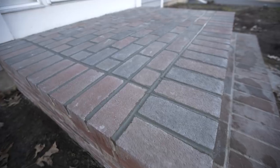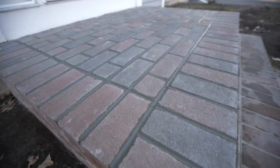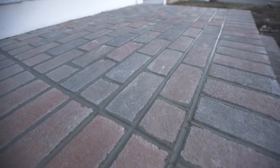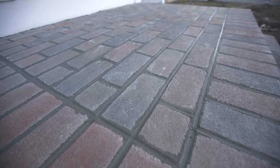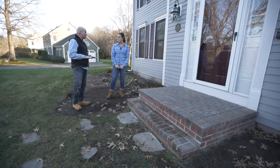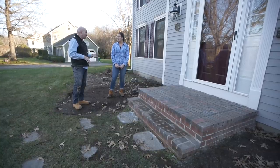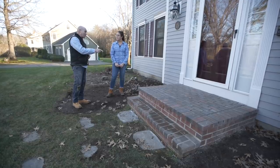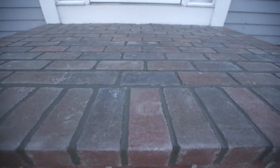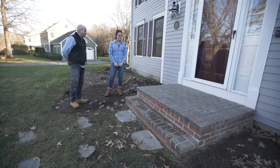Okay Michaela, what do you think? They look amazing, they came out so great, Mark. You guys did a great job. I have a question — every fall I come out and waterproof and seal these before winter so they don't crack again. Is that going to mess up what we've done? I would never waterproof a platform on steps, only because it makes a seal on the brick — the water doesn't penetrate, it just beads up and forms a sheet of ice during the winter. But we've actually waterproofed it already — once we slicked those joints with the steel tool, that seals the mortar. You should be good forever.